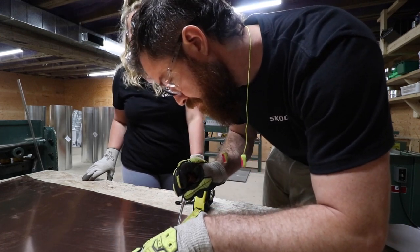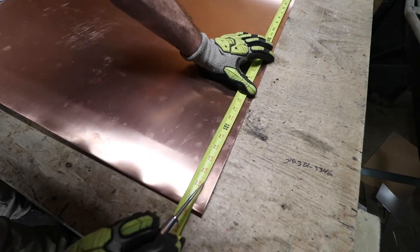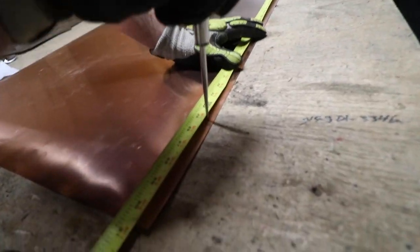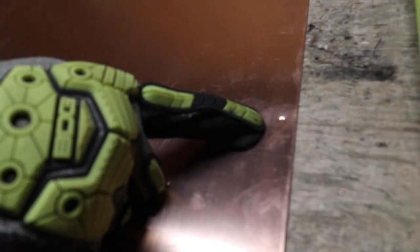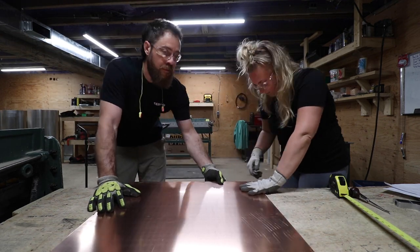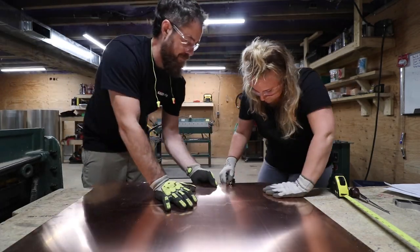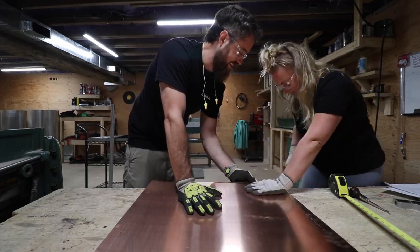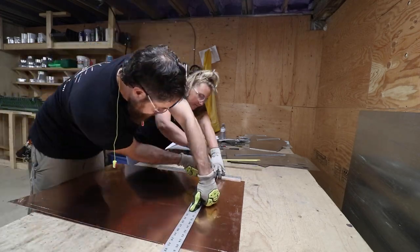Our sketched up plan showed us the overall dimensions the copper sheet needed to be. Following our plans, we started by measuring out our cut lines and bend lines, which we scribe or scratch onto the surface of the copper. For the first cut, we lightly hit the handle of the awl to make a small indentation on either side. These two dimples will align to either side of the guillotine blade. We used a T-square to mark out more bend and cut lines. Mr. Accuracy.